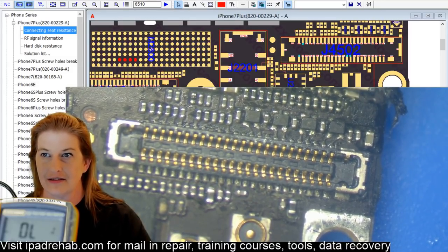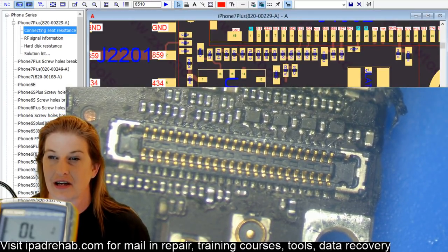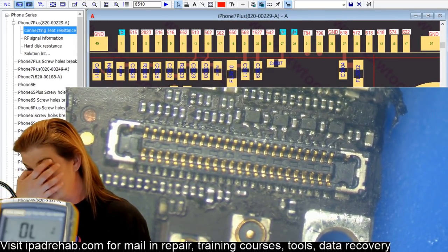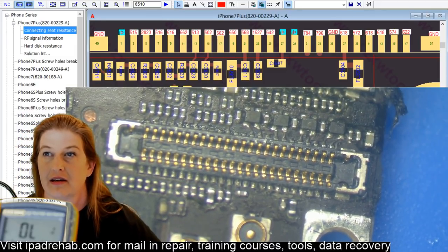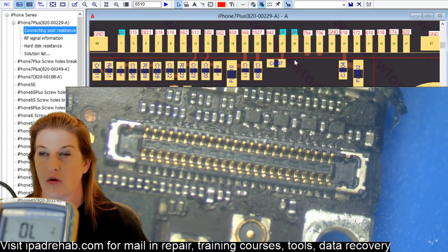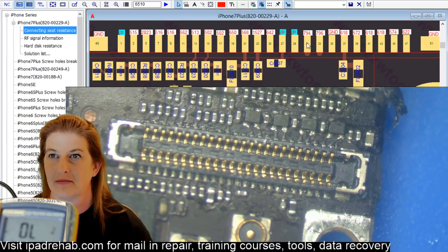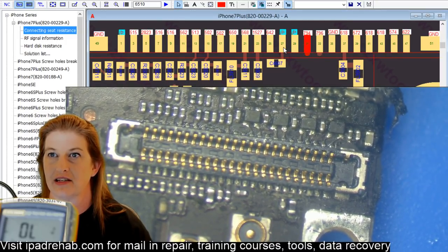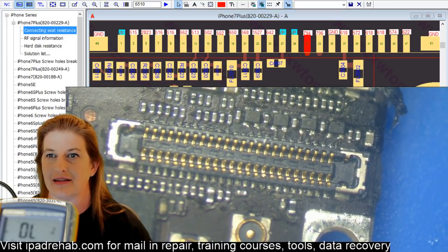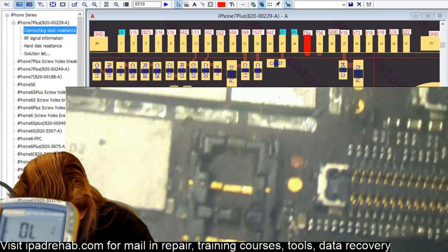None of that makes sense for image — it's all backlight. So let's look back and see if we can find a difference that is relevant to image. I thought there was another one — it was right after the two OL pins, where the value should have been 0.794. Let me re-check. Going open, open, and then 0.6 — that's where I said it could potentially be a little low.